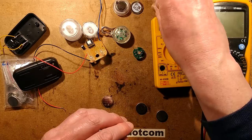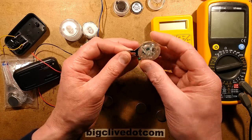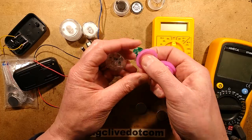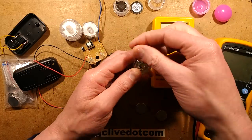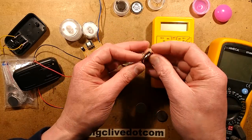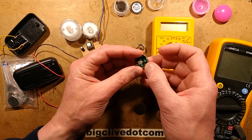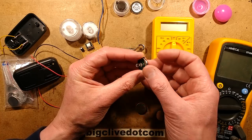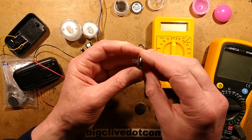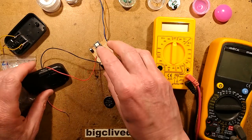The other one I was looking at was a dog collar light, which has got a carabiner. It comes in two parts — a front and back bit — and they snap on over the carabiner. It takes a single 2032 cell on a circuit board that's quite clever, because the back contact for the negative connection is actually a tactile switch, which doubles up as not just the switch but also the button — you press the cell to activate it. However, as I say, this video is not about these lights — it's about the batteries and the charger.